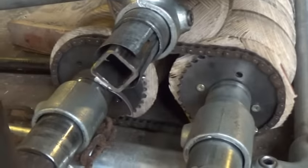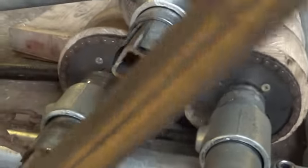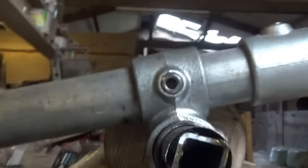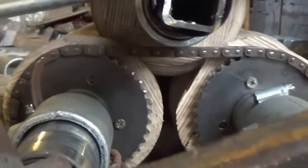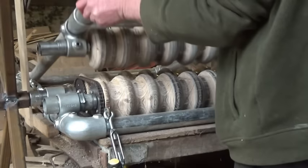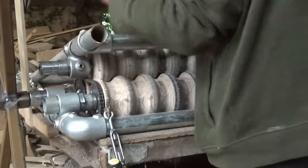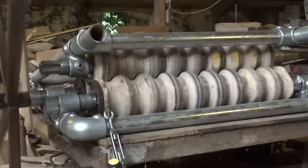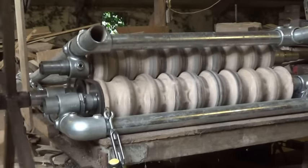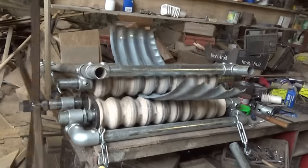So I took everything apart and reconfigured it so the rollers were closer together — I'm guessing that's the reason for the kinks. I had to make some more sprockets so the two bottom rollers are the driven ones. The last sheet of corrugated iron I had, I cut it up carefully, and I rolled it very carefully. It was a whole lot better — still not perfect, but much less kinky.